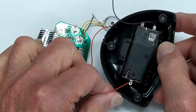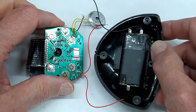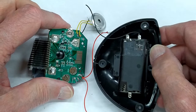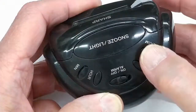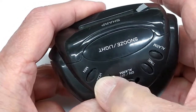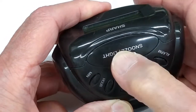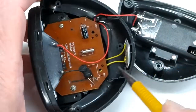You'll notice how easily these very fine wires break off, so you'll have to pay attention to where they were connected and be prepared to re-solder them. And as you set this, all of these click. Piezoelectric buzzer — that's your alarm.